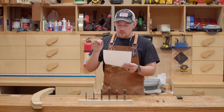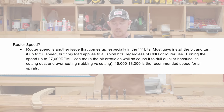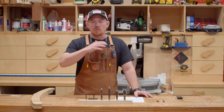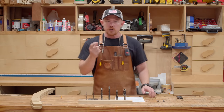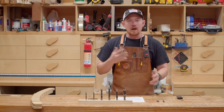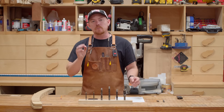Turning the speed up to 27,000-plus RPM can make the bit erratic and cause it to dull quicker because it's cutting dust and overheating — rubbing versus cutting. 16,000 to 18,000 RPM is the recommended speed for all spirals. Start low and work your way up to find the best results. That's especially true on larger diameter edge-profiling bits like a one-and-a-half-inch chamfer or round-over bit. Start slow with the RPM, work your way up, and you'll get much better results with far less burning.